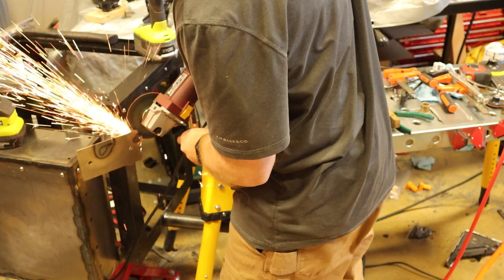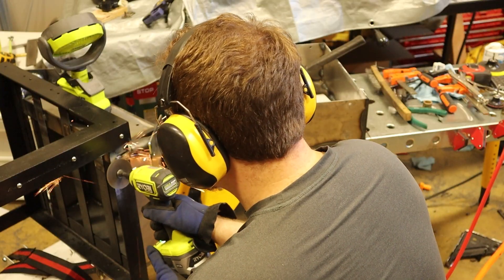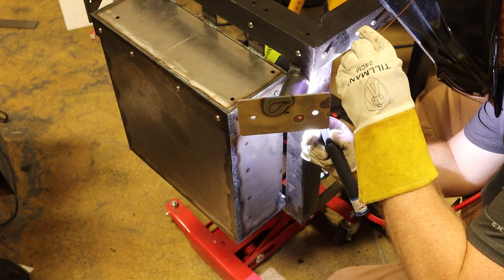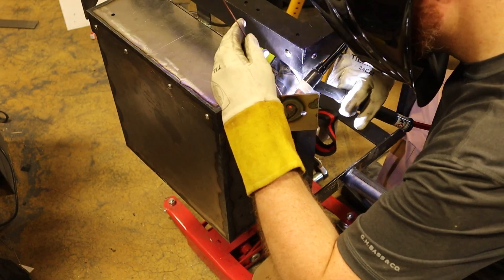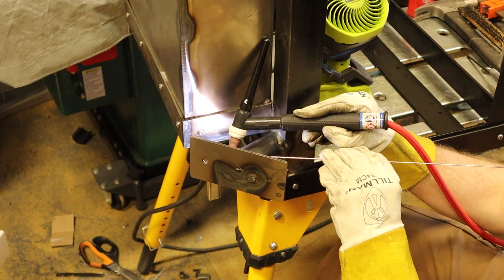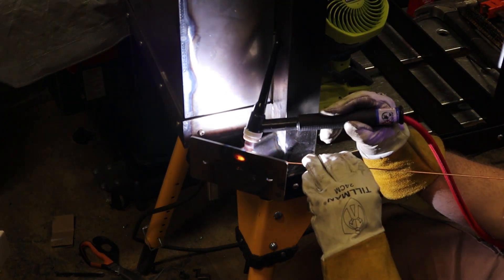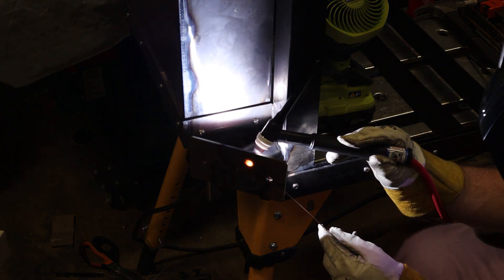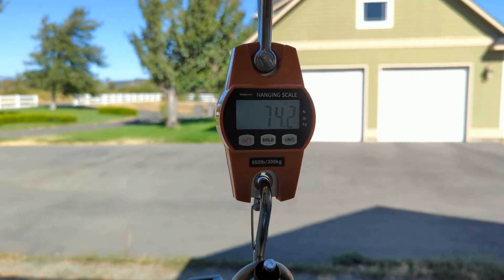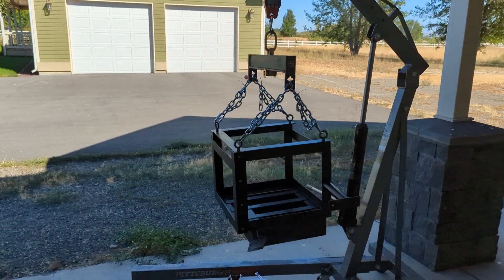I cut off the temporary piece that was holding the mount plate in position and used the grinder to remove the remains of the tack welds. This is my first time welding round tube and I found it pretty difficult — the angles are weird and I had to reposition myself over and over because of all the other things in the way. A tip I learned: drill a small hole in each of the mount plates where it goes into the tube, to prevent pressure building up in the tube and blowing out the weld. With the welds complete, the pack was given a coat of black spray paint and weighed in at just under 75 pounds.